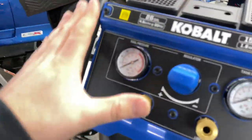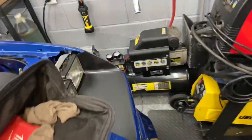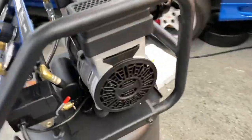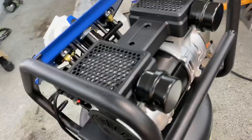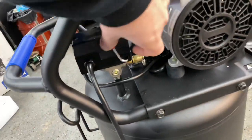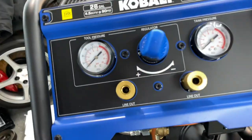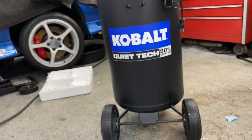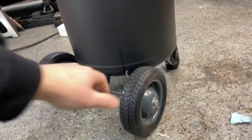So a little up-close look. I really like this about it — everything is just kind of organized. You have an operating panel here, whereas with the little Harbor Freight one, everything's just kind of thrown over at the bottom at floor level. The actual compressing part itself looks pretty cool. We have dual air intakes here. The on/off is right back here. We've got a drain valve. I'm probably going to pull these off and just put the hose directly on here because the quick disconnects could be kind of a restriction. Even on the compressor itself it says 80% quieter. And solid tires.